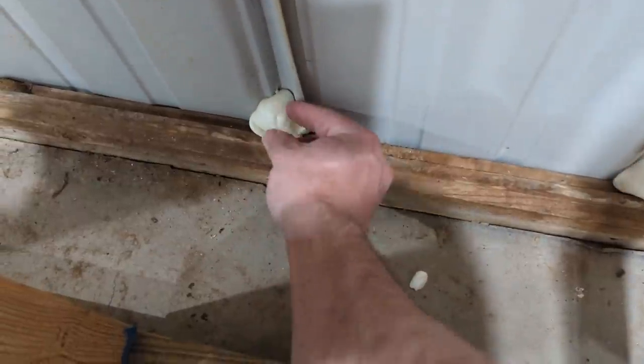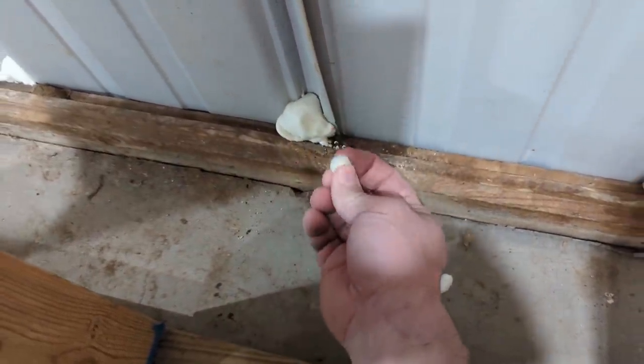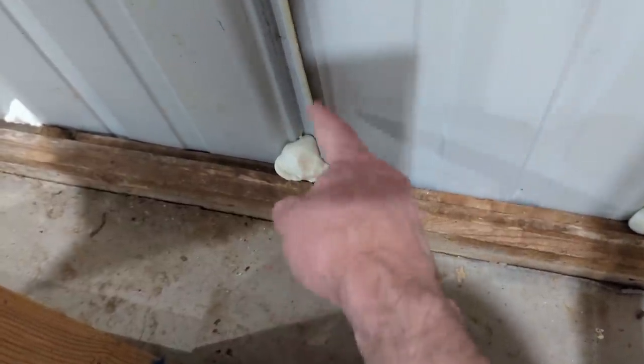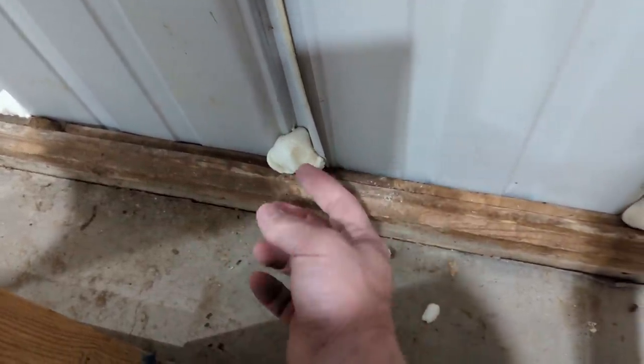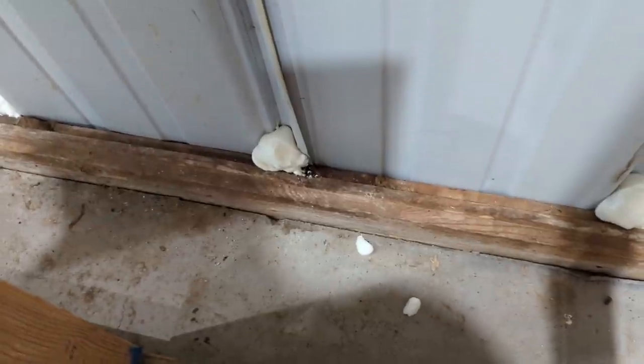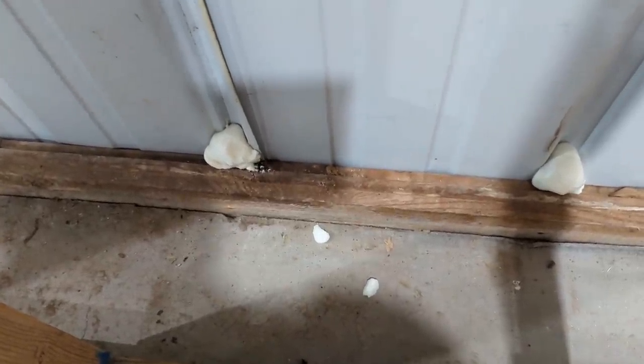And then I used some spray foam in a can to fill up the gaps like you're seeing here, but this is pretty soft stuff. A mouse wouldn't have any problem chewing through that, but not with the metal in there. So the metal is now embedded in the foam and they can chew through the foam for a minute, but when they get to the metal, I think that's going to stop them in their tracks and we won't have any problems with critters inside of my walls.